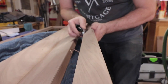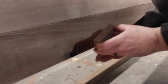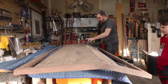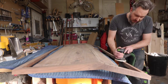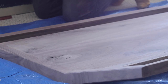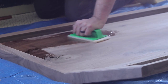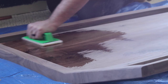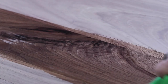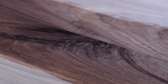With the glue dry on the headboard and the footboard, I was able to move on to some of the final details, which also included installing blocks to bring my middle support back to 90 degrees. In preparation for finish, I sanded everything down to about 220 and then brought the pieces inside to apply the Osmo as my finish. I think that applying finish is the ASMR of the woodworking world — the Osmo made everything just come alive and it felt so good to finally be at this point in the build.